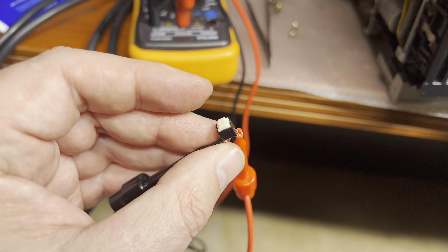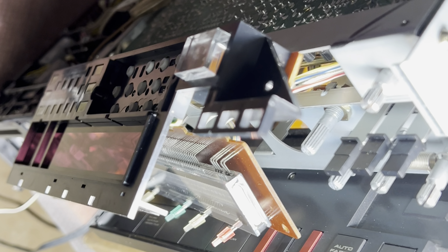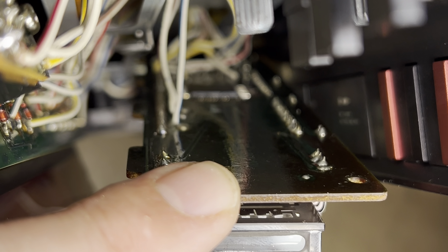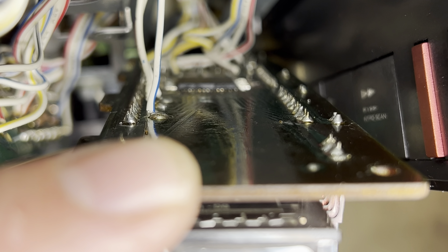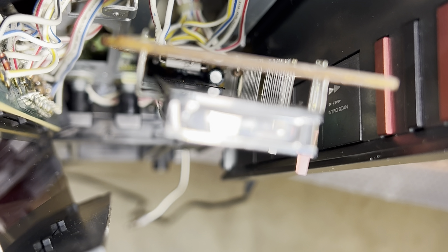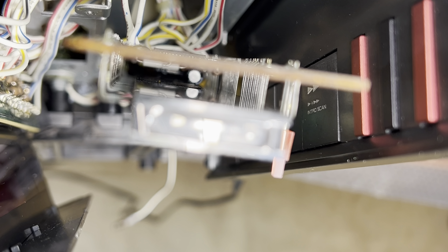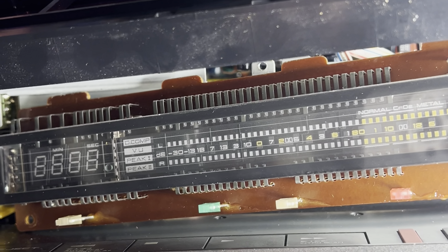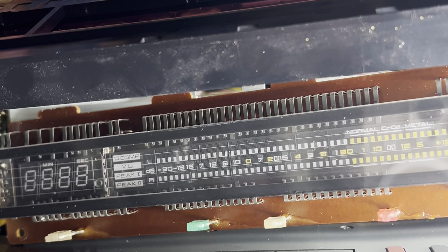Ready to put it back. I found another sophisticated solution — on the back of this board there is a large IC installed. But more interesting: capacitors are installed in between the indicator and the board. So if I decide to replace them, I have to fully desolder this indicator with all its legs, then replace the capacitors, then put it back.